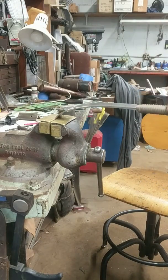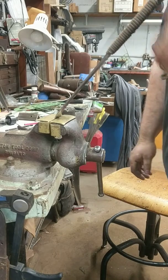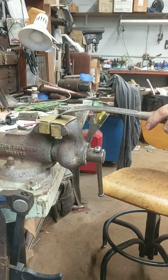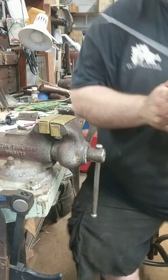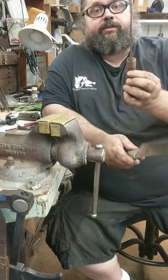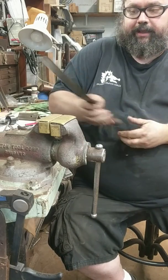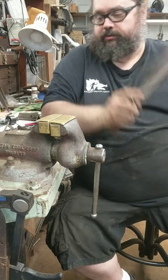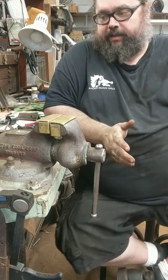Let's try bending this one again. You can see it just kinking right there and then coming back — pretty sure that was 90 degrees. So while this is technically a passing knife, I like the first one a lot better. This knife is still usable, but not as much so. I like to make a knife that's going to pass the test and still be usable afterward.